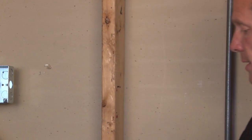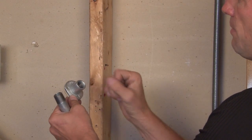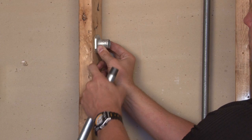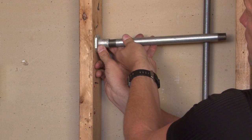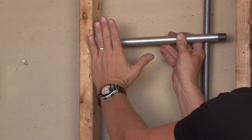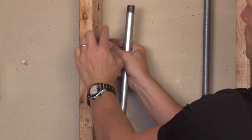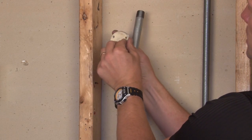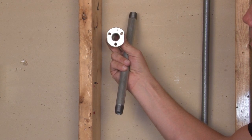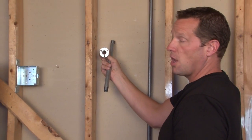In the same respect, we have a straight electro form pipe insert that is gasketed and has three mounting holes. The same principle applies — it's mounted to the wood form, and on straight runs the pipe is inserted. The concrete is then poured, completely encasing the pipe and the hub. Once the wood form is stripped away, the gasket is removed, the plug comes out, and you have perfect threads to receive new conduit connectors, hubs, or fittings.